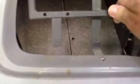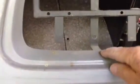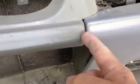The rear quarter panel comes back here. This is a support for the tail lights, and I can put a bolt in there too, and then when you put the bezel over, it hides that. There's a tab off of the structural steel in here that goes out between these, 1/8" steel, and you can bolt this piece to the quarter panel there and keep that in alignment. And then down below the same thing. You can see there's maybe you can't see it. There's a piece of steel between those. It comes off this. You also have a bolt that goes through those two to keep them in place.